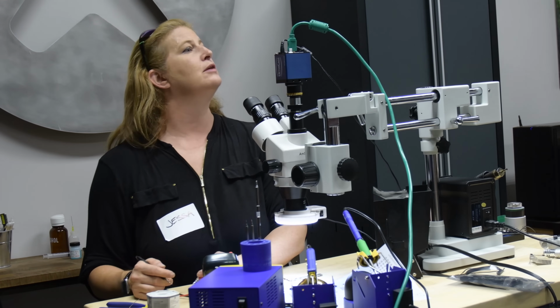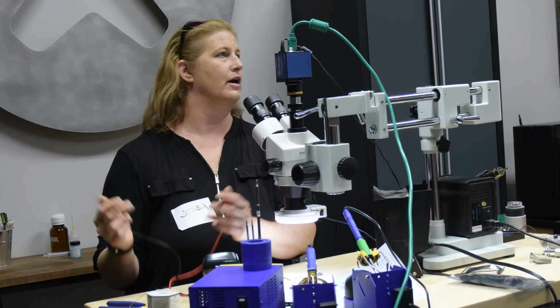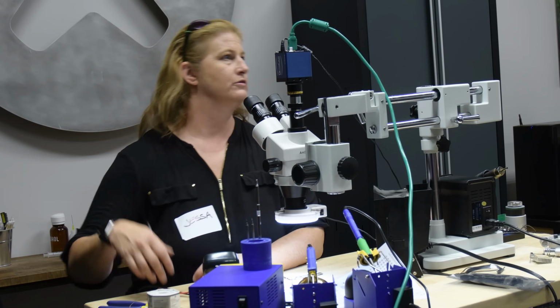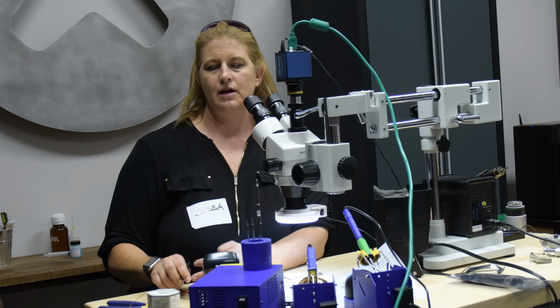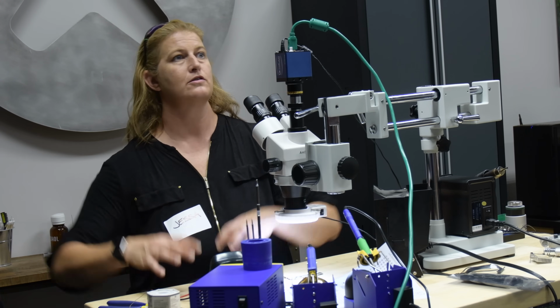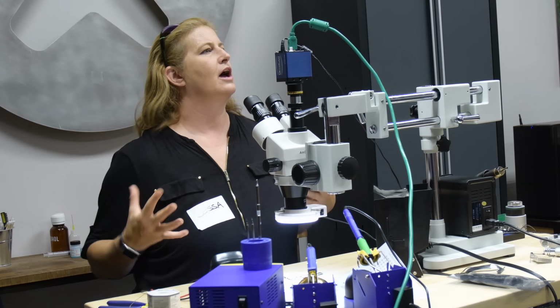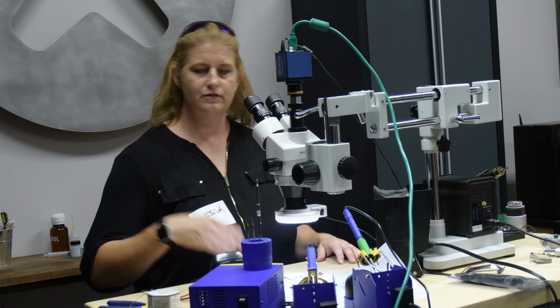So on a normal line, what would we expect if we were to just measure straight up resistance to ground? What kind of number would we expect? I don't know, 100 kilo ohms or 500, something like that, but some kind of a big number, right? That's true for most lines that are going to carry a voltage and send current, they're going to have some sort of resistance to ground. However, there is a caveat.